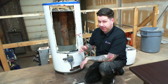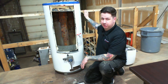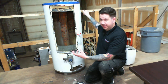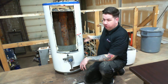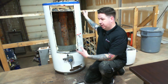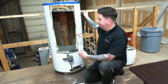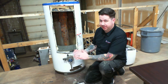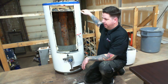The only line of defense to protect you in your home is this — what's called a temperature and pressure relief valve. If it senses any pressure increase in the tank beyond what it's manufactured for, the pin opens and lets water out. Once satisfied, it should close. If water continues coming out, that means there's something more concerning with the hot water tank. If the water is cranked up too hot, it will sense the temperature, open, and release water until satisfied.